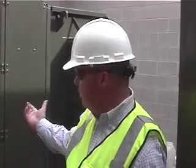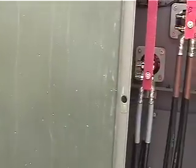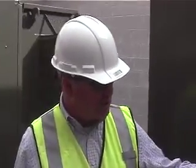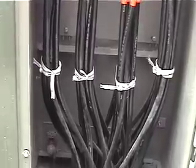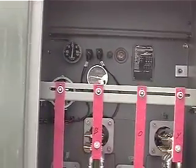We've now moved outside to the transformer yard, and we have two oil-filled transformers here. The high-voltage section where your 12,470-volt feed comes in uses the same kind of elbow as we saw on the switch inside the switch room next door. The low-voltage section has your bus supports for your cable, and everything looks extremely neat and tied inside there. This low-voltage section is where you'll find the gauges — you'll see a temperature gauge, a pressure gauge, and a liquid level gauge — three gauges in there.